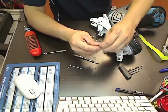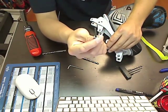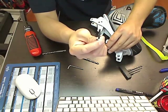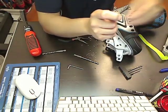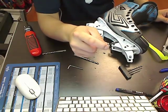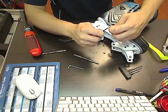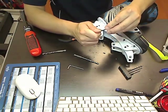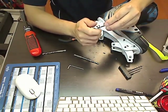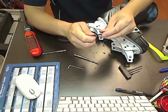What I usually do is take a T-nut and a screw that is about an inch long — this is quite long, not the one you're going to use eventually. Using a longer screw helps you pull the T-nut into the hole. Once it's in the hole, you take out the long screw and then put in the proper length one.